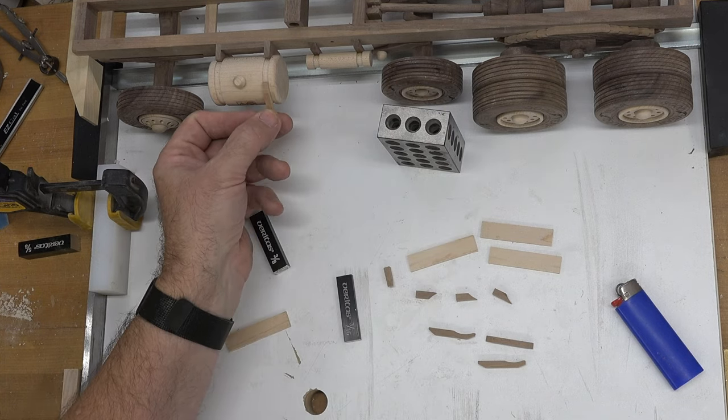But we'll also take note here that it shows this 1/16th of an inch at the bottom and shows the entire length of the piece here of this side upright as 2 5/16. Well, if we add a 1/16th to that for this small little detail at the bottom, that's 2 3/8. So I've actually cut them slightly longer, as well as this bottom brace here, which measures 1/4 inch. If we add that 1/16th that we see at the bottom there, that's going to give us 5/16, and that's how wide I've cut it. The top piece is 3/8 inch.